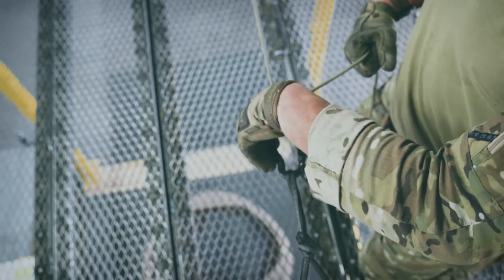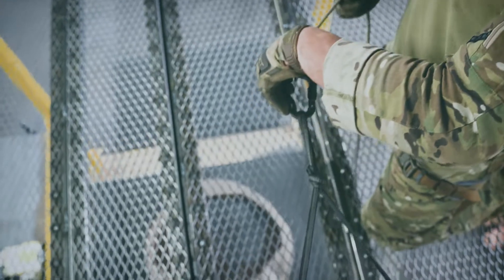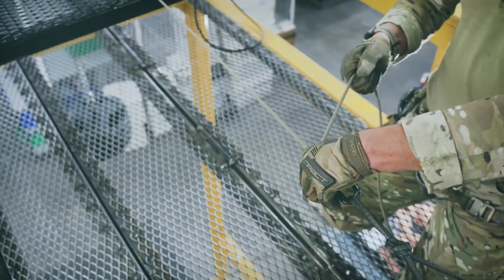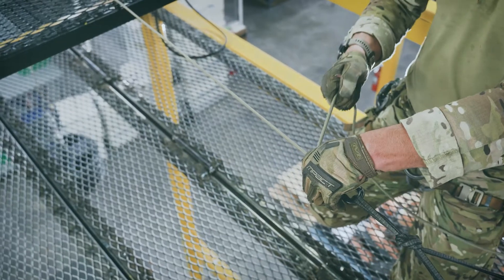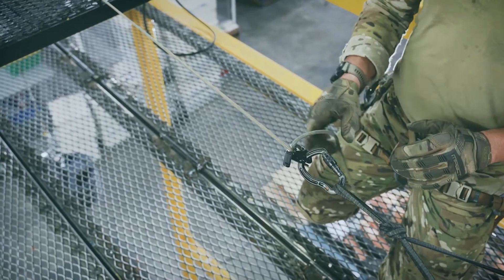To actually do the lower, it's no different. You can see how the sling on this anchor is flexible — I'm just going to move it so it's up. Even though the natural orientation is to the side, it's not affecting anything. Then just squeeze — press on the gas and release the clutch — and you can slowly lower the load down. If you need to stop for whatever reason, just stop. You can let go of the system as long as there's tension on it; that's not an issue.